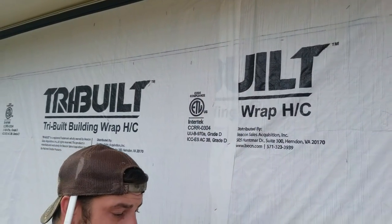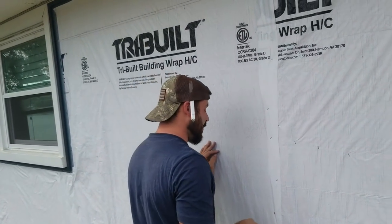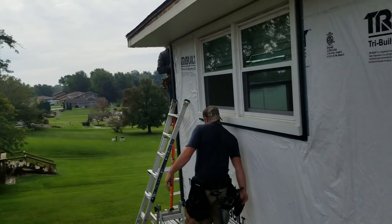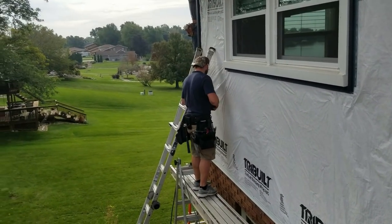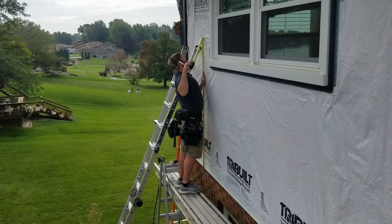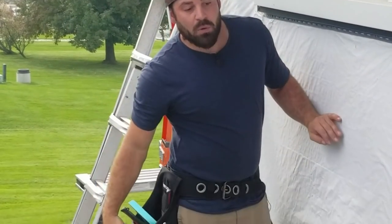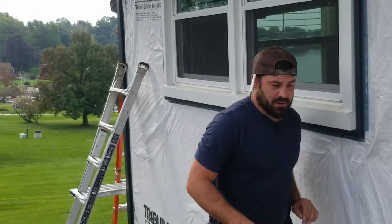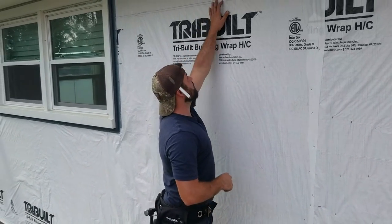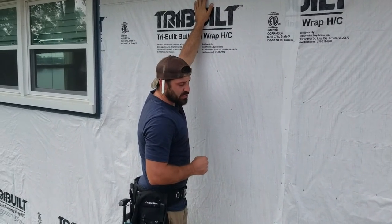So this is really good siding that can easily be worked up, in no time at all, really. We could probably work that out of our first two rows if we wanted. But let's check this side. Hopefully it's pretty close to 88 and a quarter as well. Exactly 88 and a quarter. So now we're really, really close to our line. We were at, I think, 88 and three quarter, which you don't want to try to stretch. And even if we did get just a touch short of this line, which I don't think we're going to, then we're going to be fine.